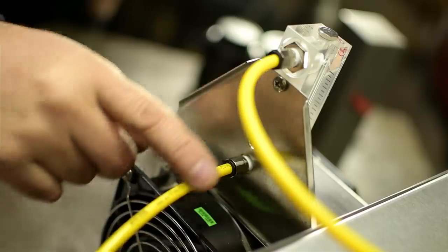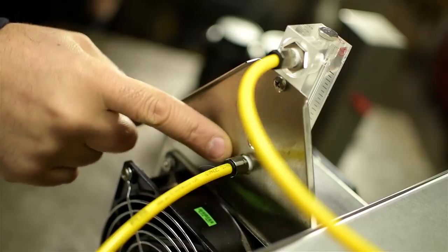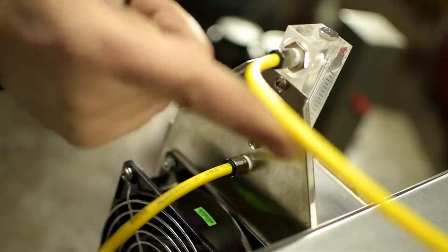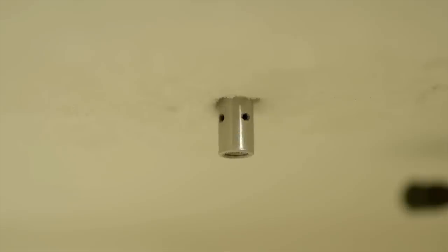That gas then comes down into the bottom of Stan's flow regulator. It's pushed in, I assume, by this fan, and out the top and into the oven chamber. Inside the oven, it's diffused by that tube we installed earlier. It's Inconel, should be able to handle the temperature. It's capped on the bottom and has 4 jets coming out the sides. It doesn't rotate, I'm doing that from the top with my hand.